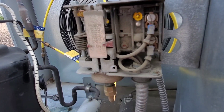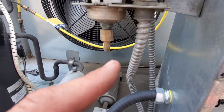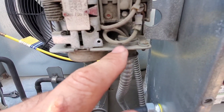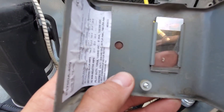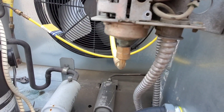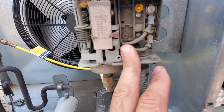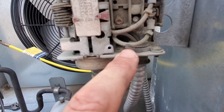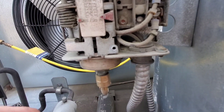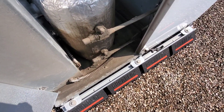On this one here there's quite a bit of dust, but I revealed one thing I can rectify right now. You can see this little rub-through right here, and you can also see it on the other side of the cover. We're going to have to fix that — maybe zip-tying these wires together and pushing them back a bit. Things like this is what we find on a PM and we can rectify it now so in six months or a year from now, we don't have a short in this machine.